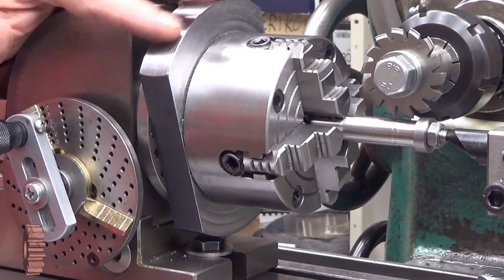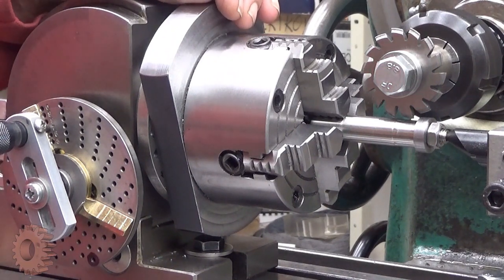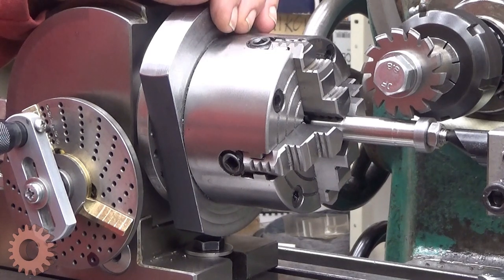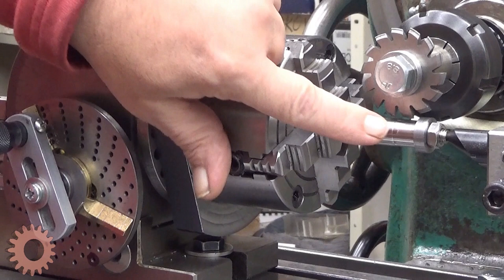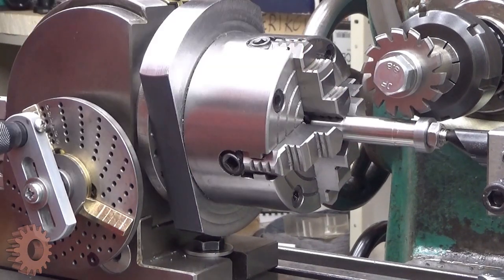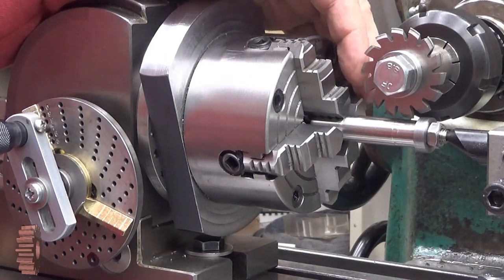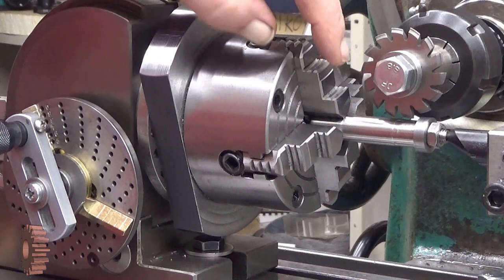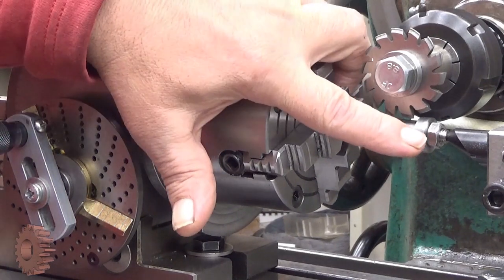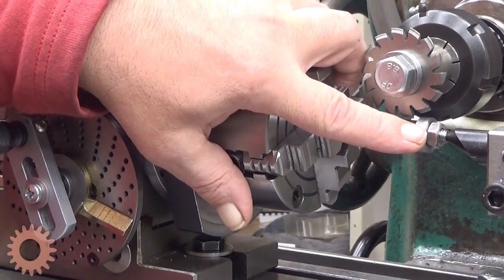So, now, well, this is my BS0 dividing head. At the moment it's well set up for milling a module 1, 17 teeth gear. So, gear blank is that small thing there. All this around here is just to make this happen. First of all, this mandrel is now dialed in at a very good center. At the surface of this gear blank, there is less than 1/100th of a millimeter deviation.